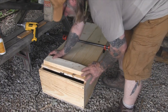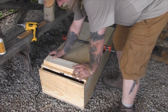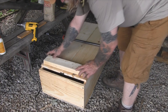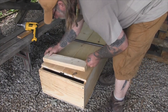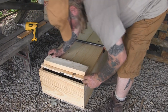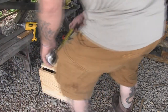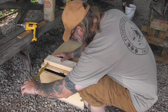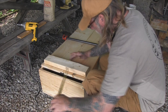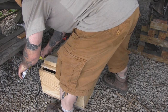This is a 17-inch board. We need to cut just inside that 17 inches to make it a little bit short — not a sloppy fit, but not a real friction fit either because we don't want to put any stress on the box. I've cut it just inside the line at 17 inches and I'm eyeballing it over the top to make sure it's going to fit. I put a bunch of glue on this now and I'm setting it down, moving it around a little to spread the glue out and eyeball things up. I want to be about three-quarters of an inch back on each side — actually I'd like to put this at about an inch so it's got a quarter inch of play. I can move it while the glue is drying easily enough, and we need about three-quarters on both sides.